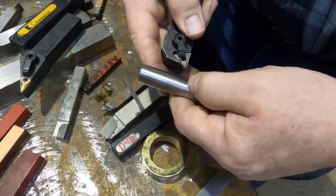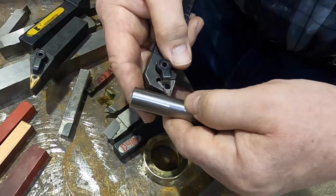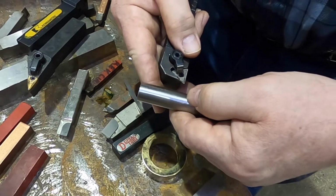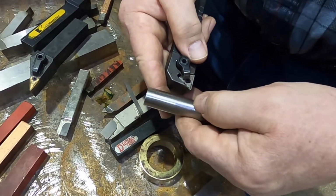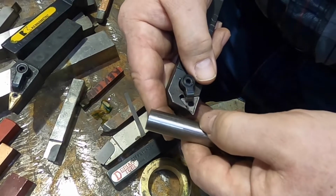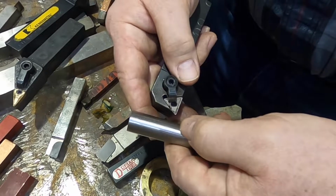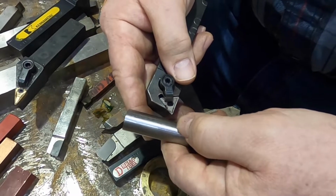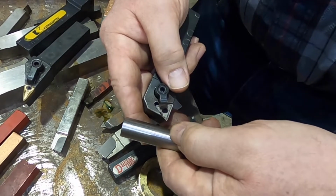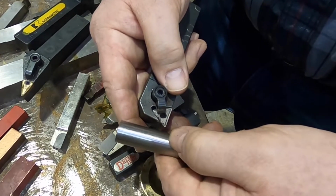What you commonly do if you are doing it on a manual lathe is you get very good at running this at the right speed, just eyeballing it to where you don't make a perfect radius, but you make one that's adequate. Then you can come back in and you might dress it with a tool that has the full radius, but not come in to make a full cut, just to dress some of your high spots. Just touch a little bit and be careful not to let it chatter. Or you will come back and look at it against a radius gauge and see where you have to dress a little more out.